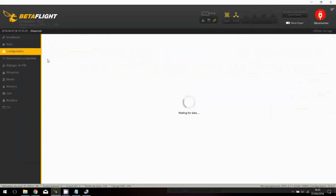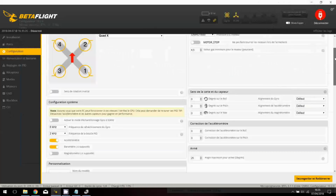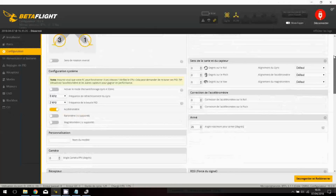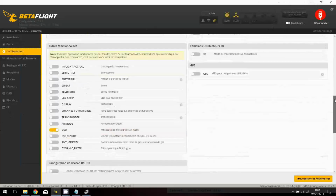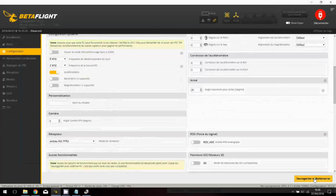Then go to the configuration. Quad X, select DShot600. Okay, you can leave this value like this. You can disable the parameters. No specific board alignment. Okay, no craft name, or maybe say SPCMaker 95 EP. You can turn on the OSD, that's all, and okay, for the current alarm, nothing special. We can save that. Okay, press connect.